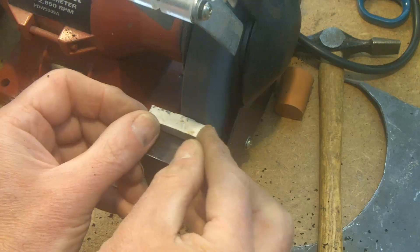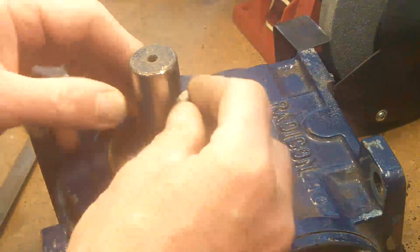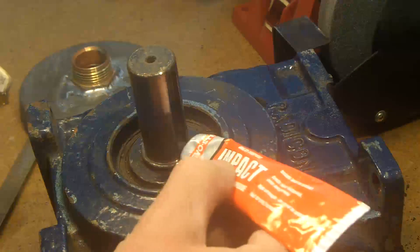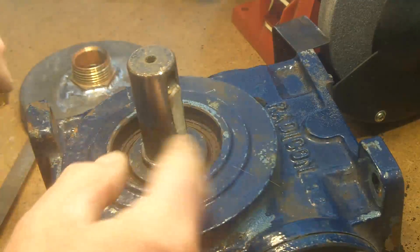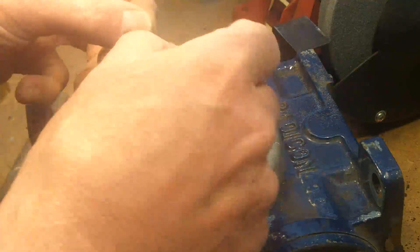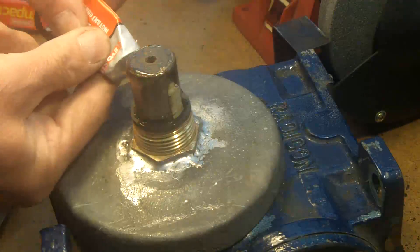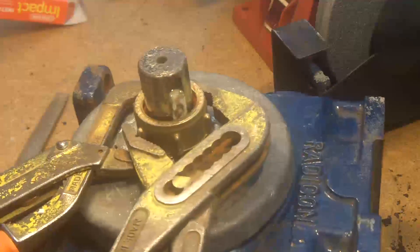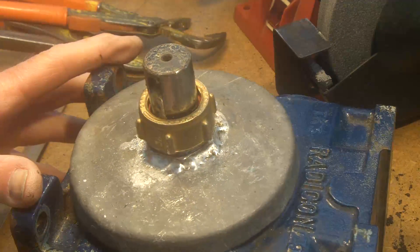Here I'm grinding a piece of white rubber to fit in the gearbox shaft's keyway, and that's it in place there — it's a good snug fit and slightly proud of the radius. I put some contact adhesive in, and that's wonderful stuff. Next is a fibre washer, again with plenty of sealant around it, and that's screwed into compression pretty tight. I reckon that's going to be watertight forever.